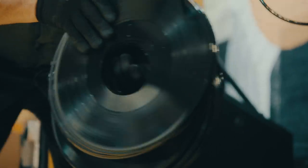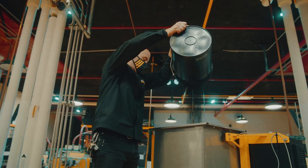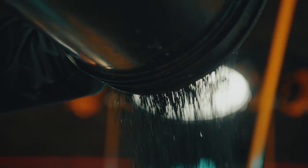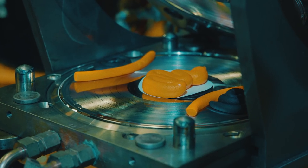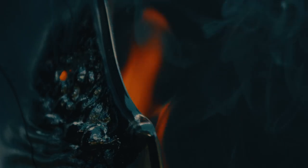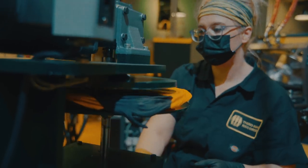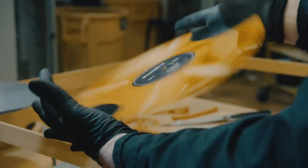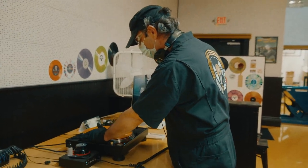Paul McCartney famously pays attention to every tiny detail of the record — physically and emotionally how you consume it. After the label is dinked out, then it goes into a grinder. Those pellets are heated to make sort of a plastic rope. That rope then gets inserted into the mold of the press, and that's where the grooves get pressed into the plastic and make your record. Then it gets inspected visually, and they hand that record off to our audio QC. They listen to the record from start to finish to make sure that there isn't any imperfection. Then it gets sleeved and then off to packaging.